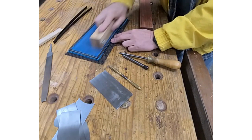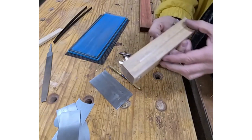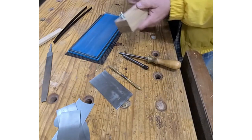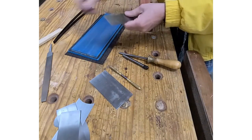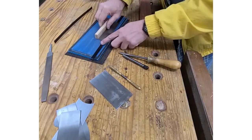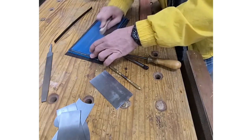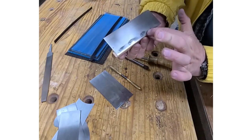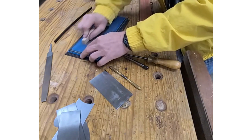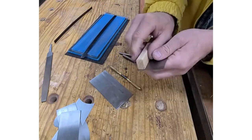Now I need to polish that edge, taking it down to 40 microns. I polish just until I can see a nice shine all the way along — and I've got it. Now I take the scraper out of the vise and use my magnet handle with one of these strips. This is the old ruler trick — it raises the scraper up just a little bit so the honing happens right on the edge. I go back and forth until I see a polished edge, then do the same on the other side. Now this scraper is ready: I've filed the edge and honed both faces.